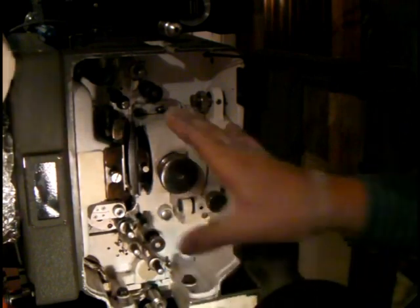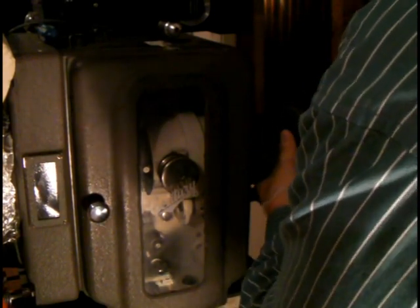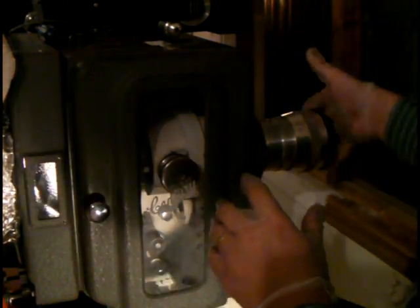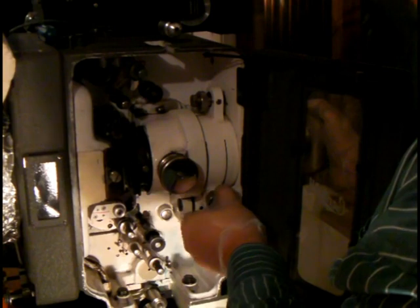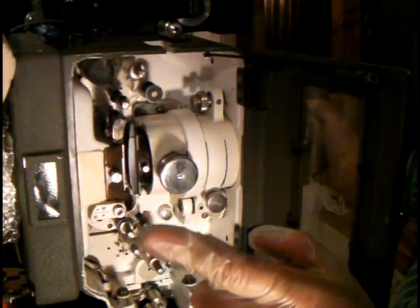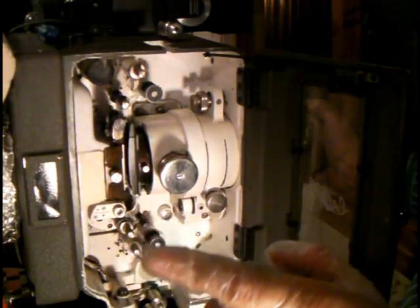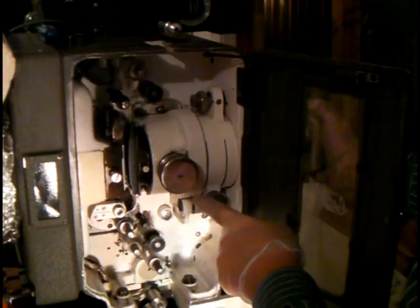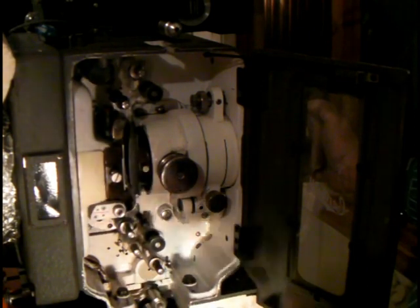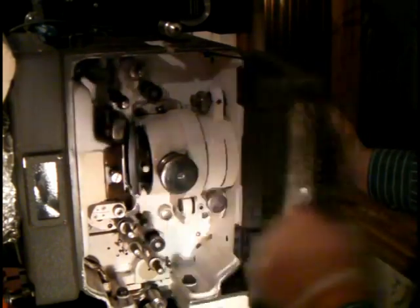Now that it's all clean — look how shiny that is — this entire unit is clean. I'm gonna slide this lens back in over here where it came from; it slides in through the front of the machine. It does go in a certain way, or else your image is going to be skewed and won't be square. Then I'll tighten it with this knob right here. Make sure it's tight, but don't reef on it — wrenches can't really grip this and there's no slot for a flathead or Phillips — so don't over-tighten it.